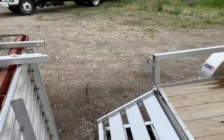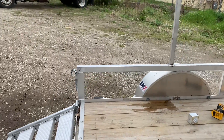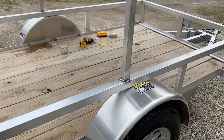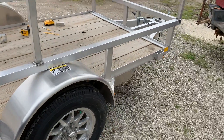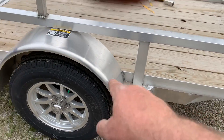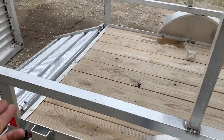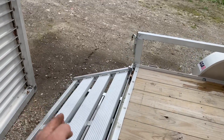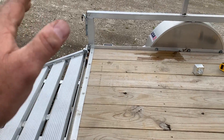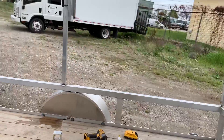I will temporarily tack two legs here — just a tack on both sides so it's not going to fall off. I'm waiting for my steel — or aluminum — to come in, which should be three or four days. As soon as that comes in I can get underneath here and finish this frame all the way to the back at both sides, put my cross members in, build my angle up here, and build my top piece here. Once I have that solidified, I can start finishing up the walls and all the aluminum struts in here that I'm putting in.